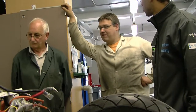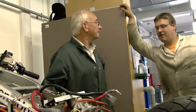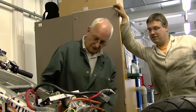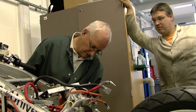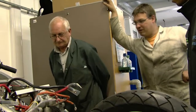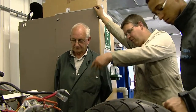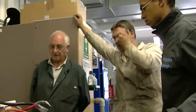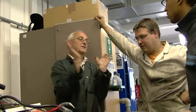That frame was never meant to hold the batteries. Well, this is designed to pick up the front. I think you need a plate across there, don't you? Except you can't — well actually the contacts will stand proud of it. But you've got to have a tie bar to stop it going down anyway.